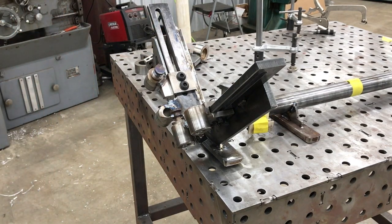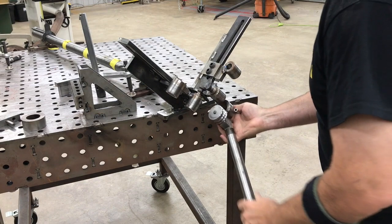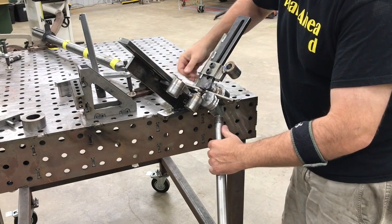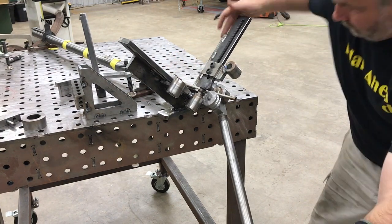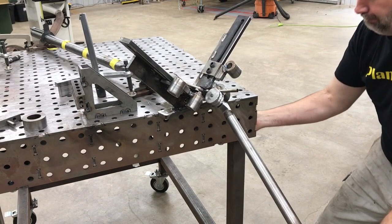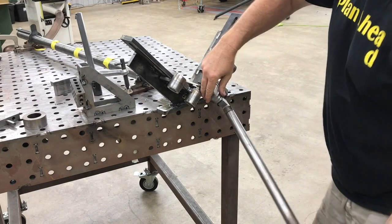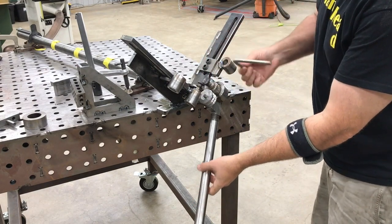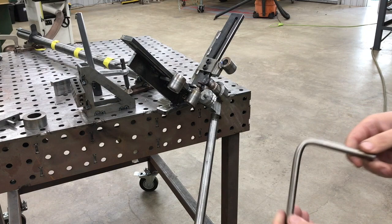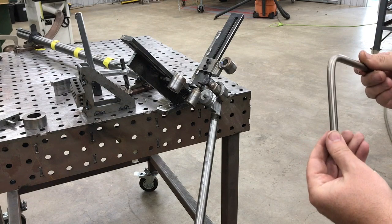As a reminder, you can see the overlay showing we're bending this V-shaped setup, and it's working out really well. I'm going to throw a piece of scrap in here and show you how this works with a handle on it. You can slide it up into the first position — this is a cutoff from the actual piece of tubing I used to bend. I was having a little bit of a problem with the table moving, but even without any heat it bends around with no problem. With heat it doesn't crimp quite as bad, but the crimp you see in the corner is very acceptable.